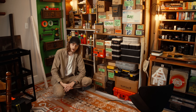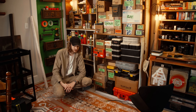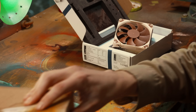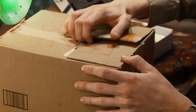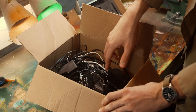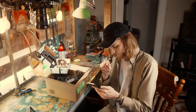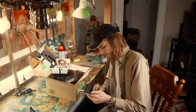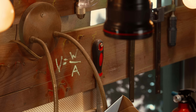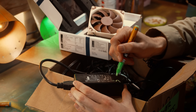But for this use case it might be running for longer periods of time, and I don't want to have to worry about swapping batteries. So I'm going to check out my box of old power supplies and see if I have anything applicable. I'm just going to trust that I've organized these well enough. Wow, the first one I grabbed — 12 volts, 3 amps. Amps equals watts divided by volts — I'm writing that on my workbench because I always forget. So if this power supply is 12 volts at 3 amps, that makes it 36 watts.